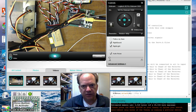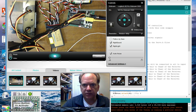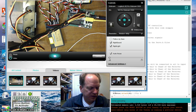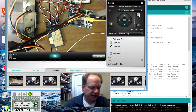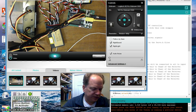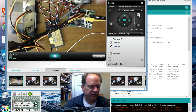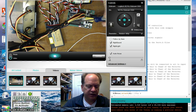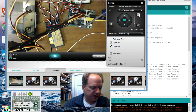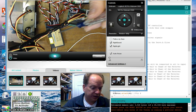The reason is that my board here is going to be hooked up to a power supply running 7.2 volts, and I'm going to have this whole side of the board supplied with 7.2 volts. I don't want to be feeding 7.2 volts into my Airtronics, so I've just left all the powers out. Even when I get my new receiver, I'm going to pull these red wires out — I don't want to be back-feeding power. These two smaller wires — the red one and the dark blue one — actually supply the Airtronics with a regulated 5-volt supply. When running off batteries, there is a 5-volt regulator right here that will supply the Airtronics or my receiver with 5 volts.